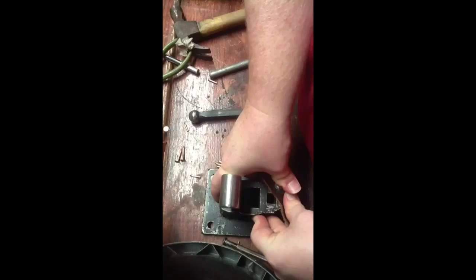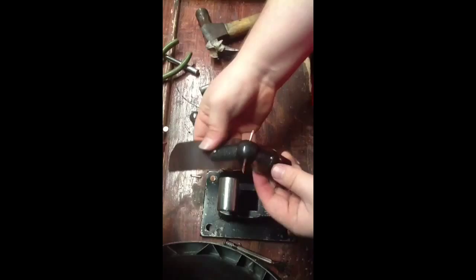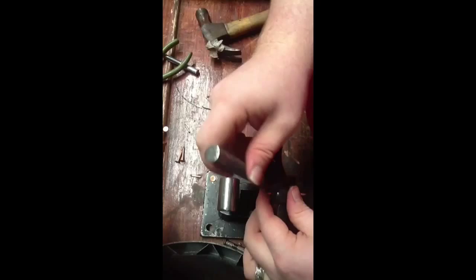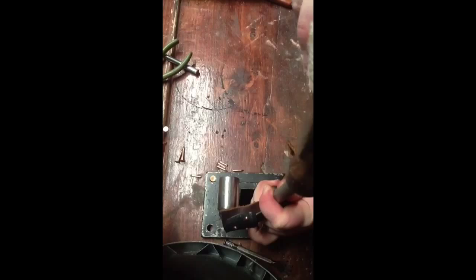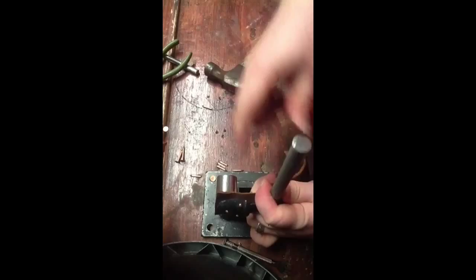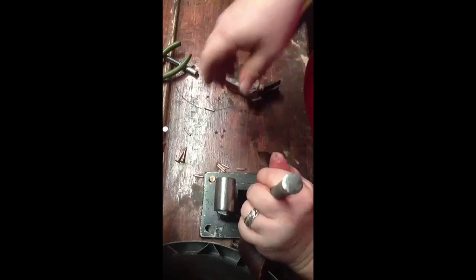Use the nail at the whole end and drive it nice and tight down. The round end fits on the inside of your knuckle. You're going to hold it by wrapping the whole piece with your fingers, squeeze it all down, grab the end of your copper set and drive this on. Nip it off and upset it just a little bit. We don't do a lot of upsetting on this first one because you can't really get where it belongs until you have the second one all the way done. Make sure it's nice and tight, nip it off, and upset it using the divot.